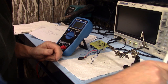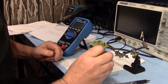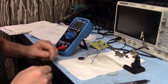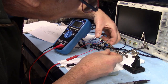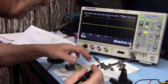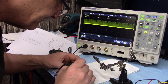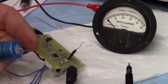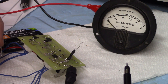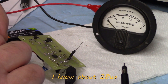Back to testing. I've made my two bodges, put that there, got my cap there. I'm not going to bother testing the switch again because I have to install it and get all the wires correct and put my two jumpers in there. Once I had passed that test case, I went to the others which used the oscilloscope to make sure my 555 was running correctly. After passing those tests, I moved on to the final test case. Let's give it a quick test to see if it's working - I got a cap here. We know that right now it's about 36. Let's put this cap on - that drops it. 31. So I know it's working.